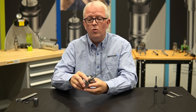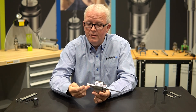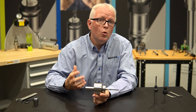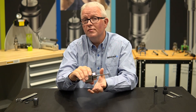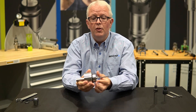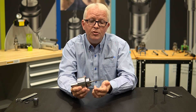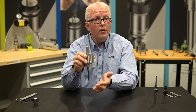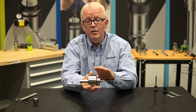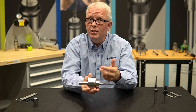So how does the floating holder work? Each floating holder, whether it be a standard size or a mini size, has a built-in spring in the back. The spring controls the tension or the force required to move the floating portion off-center. The tighter the spring, the more force to move it off-center; the looser the spring, the easier to move it off-center. That allows you to adjust for a small reamer or a very large reamer, or a vertical application or a horizontal application, making the floating holders very versatile in the way they can be used and the machines they can be used in.